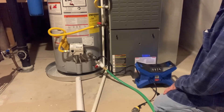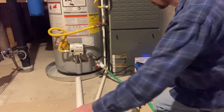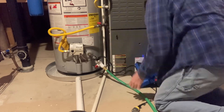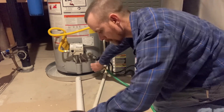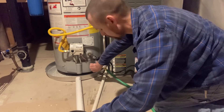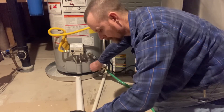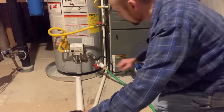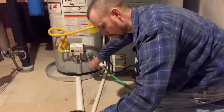Now I'm going to introduce some air into the water heater — I can hear it gurgling and bubbling. That'll stir up any sediment. Then you simply drain it out using that PVC ball valve. Do that a couple times until no more sediment comes out. Should be good to go for another year.